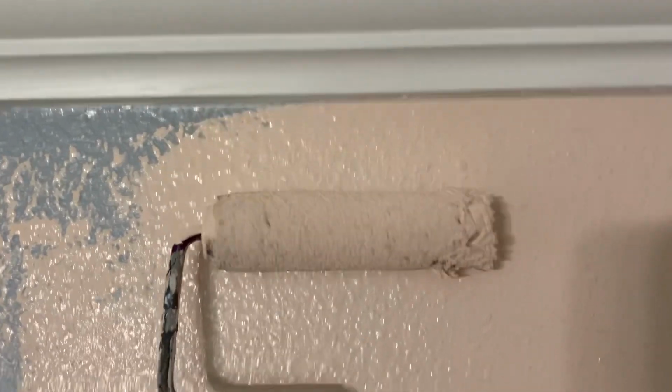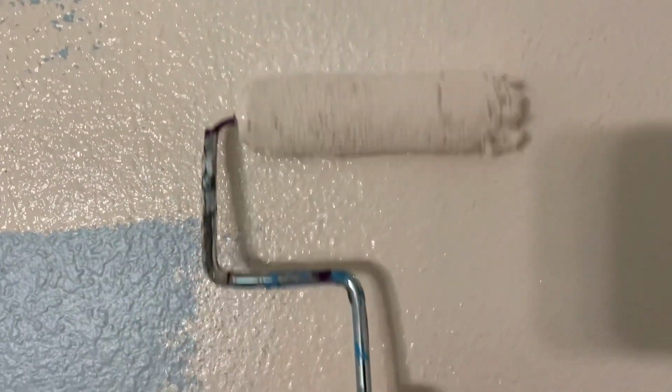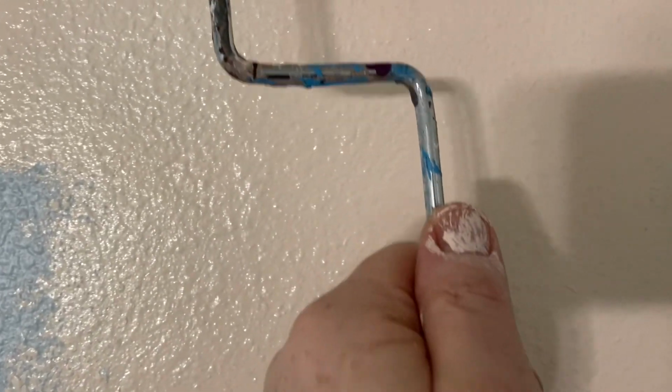And now my wall, after I get all this done, we'll be ready for this with my roller. Not this size, but you know what I mean. And you go all the way up and then down, all the way up. The idea being that this is stipple going vertically, and now we have stipple this way. But think about it. Even the finish of the entire wall with the roller, you want it all the way up and then down. Why is that? You want to make it look like you painted the wall in the same direction, going all the way up, right to the border. And then it looks like you rolled the whole thing because you have all the same texture.